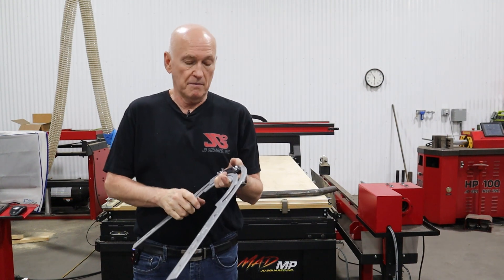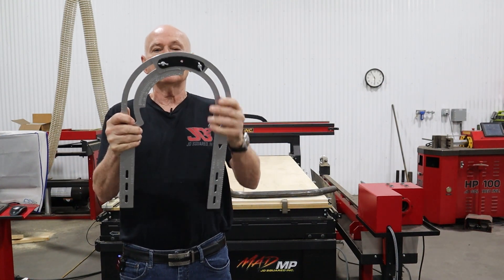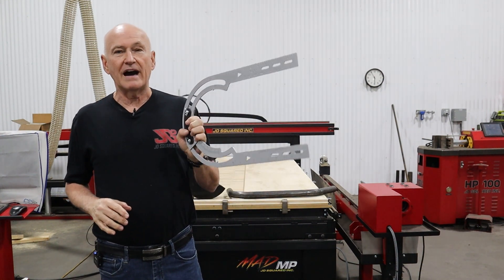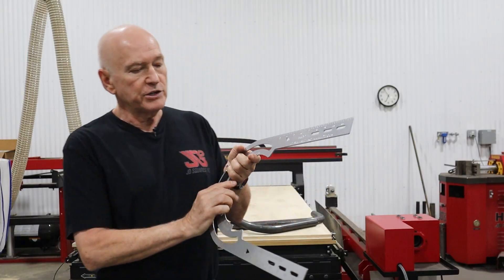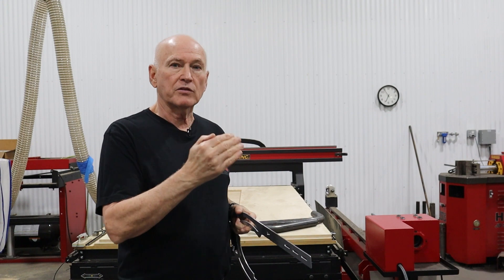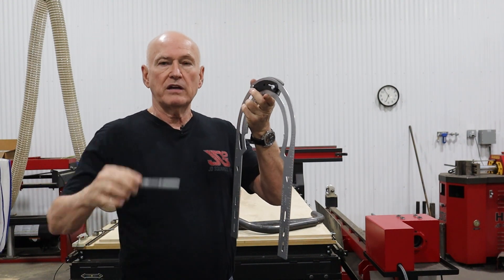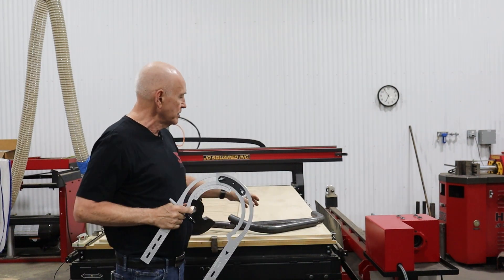You end up with this right here - a nice pivoting protractor that doesn't have a center pivot. Let's talk about some of the features. Each protractor has a 12-inch arm on it. The metric ones are marked off in centimeters; the imperial ones are marked off in inches. There is a triangular slot which allows you to take a Sharpie magic marker and place a mark through the triangle onto the tube that you're bending to help locate the bend.